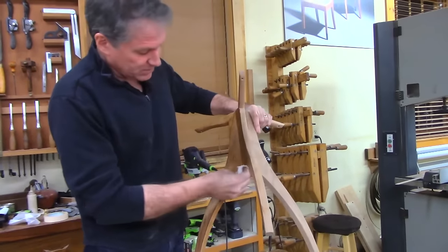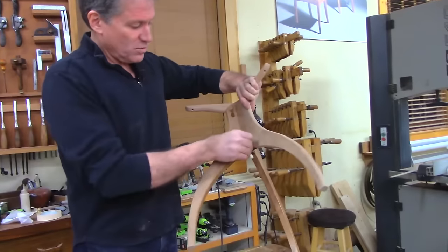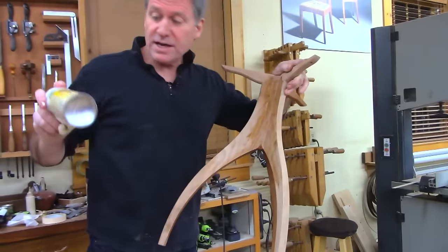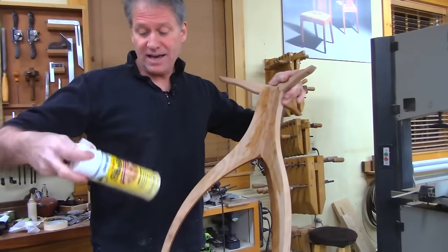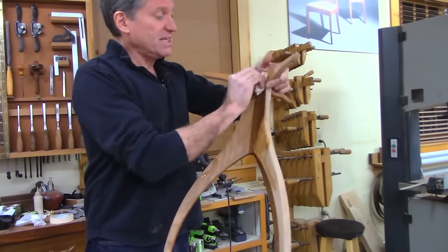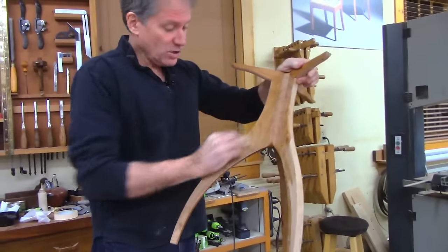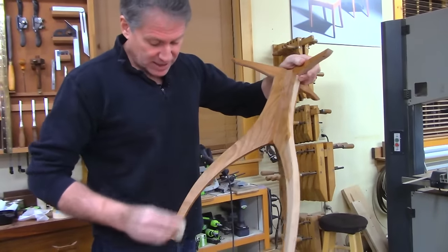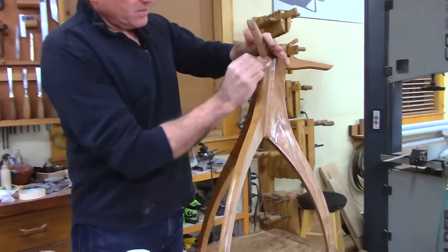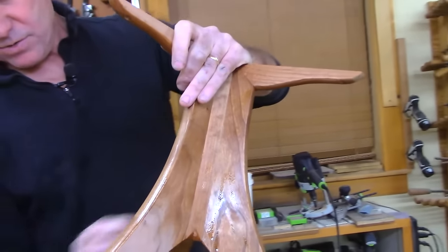One-and-a-half-pound cut is what I typically spray with. You can go a little thinner or heavier, but I usually don't go more than a two-pound cut to spray, and that's usually just the last coat. Someone asked what pound cut the Zinsser spray is. I talked to their reps — the seal coat version of Zinsser shellac, which is wax-free, is called Seal Coat, a blonde clear shellac, and it's only a two-pound cut. But the orange and clear versions I showed you in the can are still a three-pound cut.